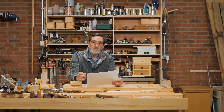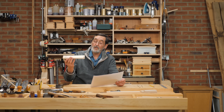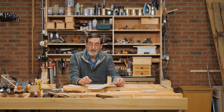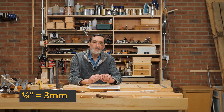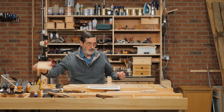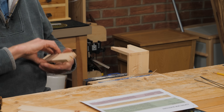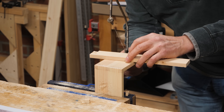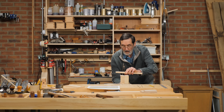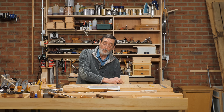What does make a difference is the thickness of the wood. A big thick chunk makes a difference — whereas with thinner pieces it also matters, but preferably with very thin materials, say an eighth of an inch or less, you might want to use the pull stroke using a platform in the vise. You'd put your piece of wood on top and work down that way, but I don't usually do marquetry or thin wood work that way.